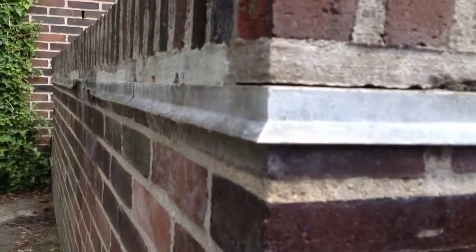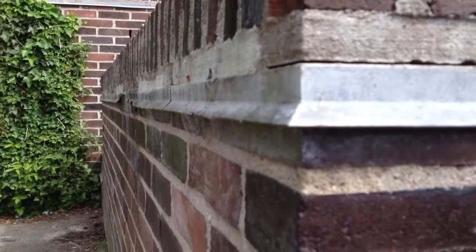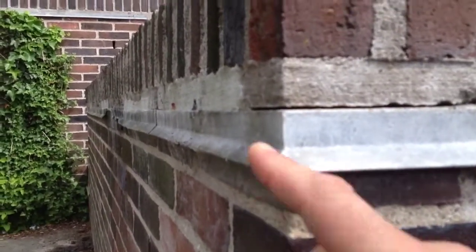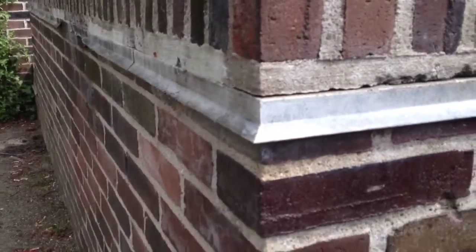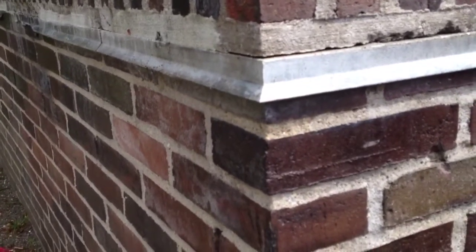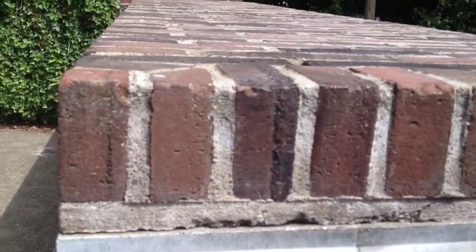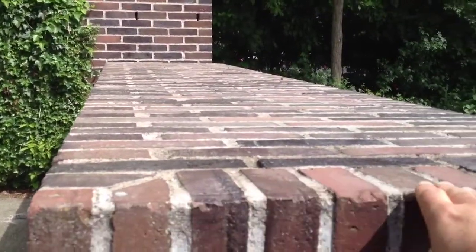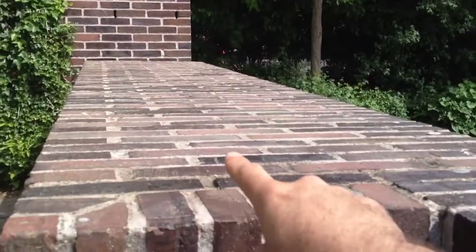So the water that's dropping down is not able to wet the surface of the entire wall, and it drips free from here. This is kind of like a rain gutter system to prevent the whole structure from being damaged or even getting dirty over the seasons. It's a very clever idea, and if you look at the profile of the sides in here, you can also see that this mortar layer here is higher than here, because they also made the whole surface lead towards this edge, which means the water is able to run in this direction.